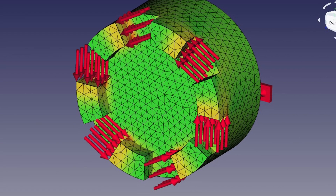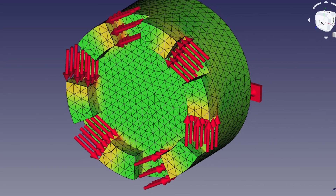Those were the features, and obviously it all revolves around smoothing transitions and rounding. That's because rounding and internal radii in particular can be a real pain to do in OpenSCAD, particularly if you start moving away from 90-degree angles, and that effectively puts a complexity ceiling on the parts that can be produced. That's a big problem, especially when you consider how important radii are for reducing stress concentrations in parts.